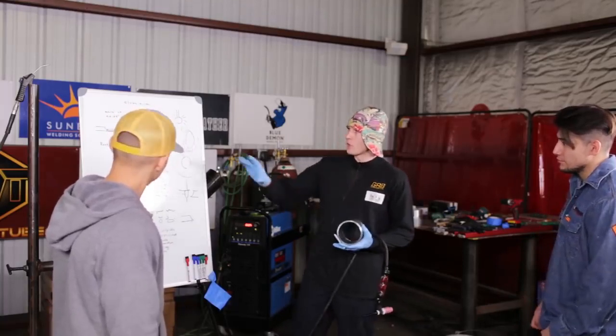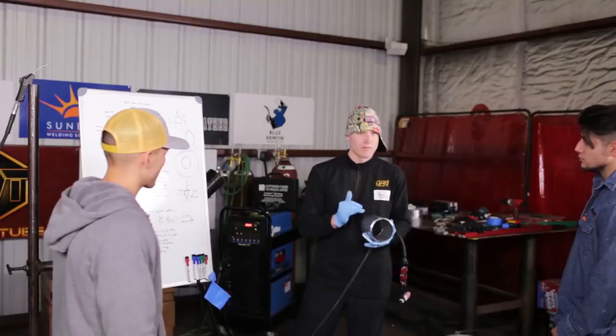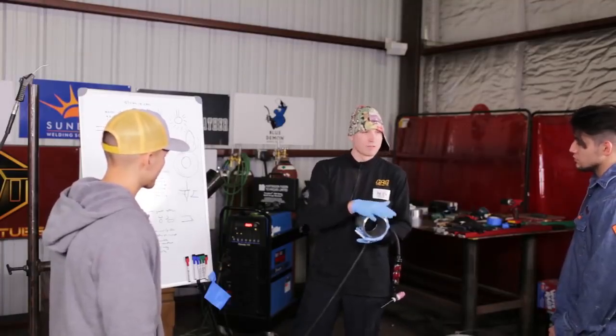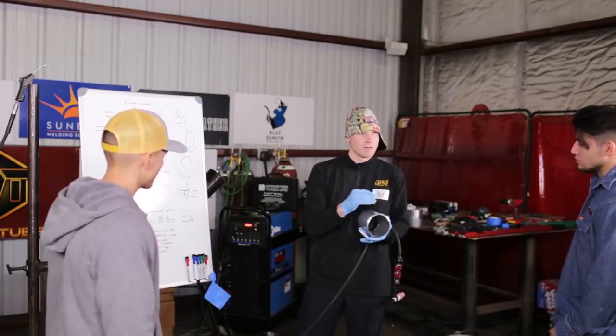And also the purge quality and the formation of oxides from the titanium video, and parts per million, also equate to aluminum as well, because as you heat up aluminum, it rapidly forms oxides. With lesser parts per million of oxygen in the atmosphere on the aluminum, you get a lesser thickness of oxides, in nanometers, that you're going to form.